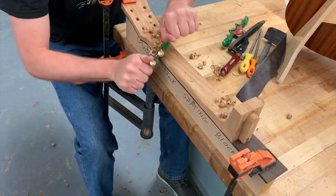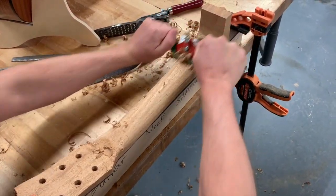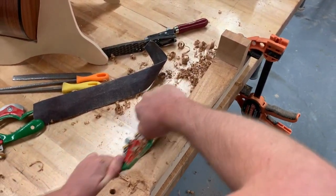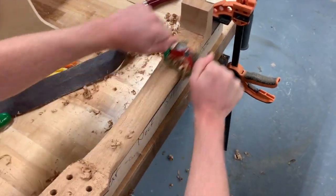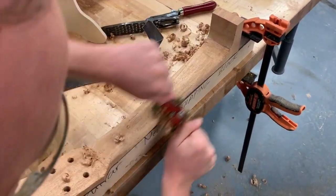You're just kind of pushing it back and forth. With the spokeshave, you're just trying to do a rough shape of this neck. It doesn't have to be perfect with the spokeshave — you're just trying to round it, get the left and right side of this neck symmetrical. Then once you get it fairly roughed out to shape, there are some other tools you can use as well.